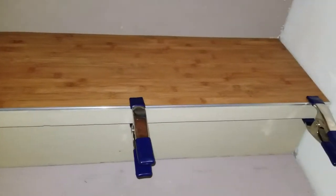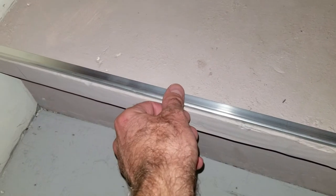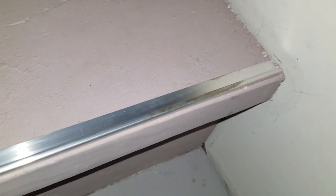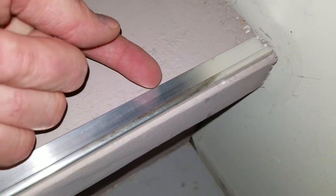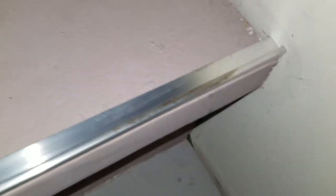If you come up here, I'm going to show you how I actually do it. I'm working my way down right now. I've got some clamps holding it. What you're going to do is put some glue on the back side, obviously cut to fit the width of the stair, and put it in place. Then you get a plank flooring, put it underneath this edge, and just like you would cut to fit the floor, you'd cut to fit the stair, and this is going to stay glued down.